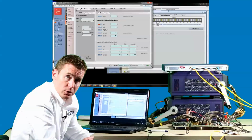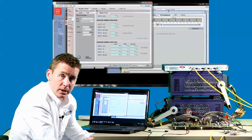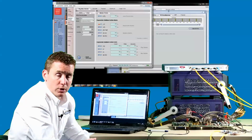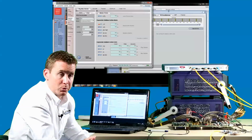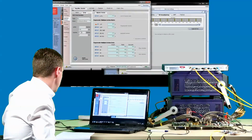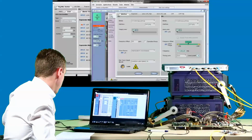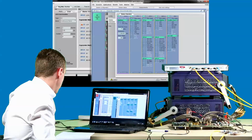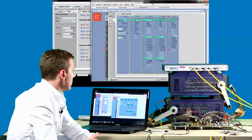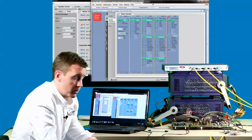Because of the replication, though, in the transmit direction, we can still send errors from the STM64 side and see those rippling through to the 100 gig box. So, for example, if I send a B3, we can see this correctly reported back on the 100 gig side.